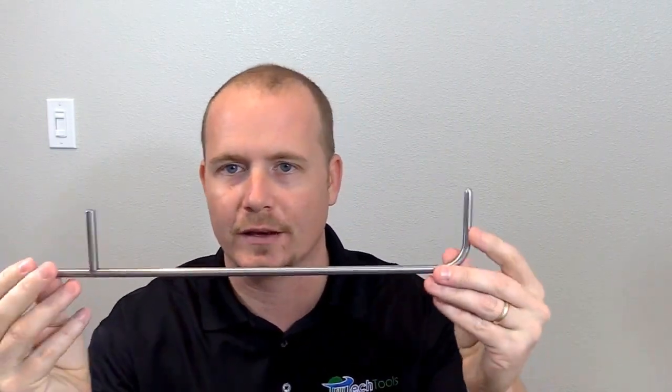There are a couple things I need to tell you specifically about the measurements I'm taking today. I'm using a short pitot tube, which is easy to handle and easy to demonstrate on a video. Generally speaking, a 12-inch pitot tube is not a really practical tool — pitot tubes are generally designed for higher velocity pressure. If you have a commercial environment with high duct velocity, a pitot tube is a nice, accurate way of doing that. I'm reading this in a residential application in an 8-inch spiral duct — not generally what you would use a pitot tube for. You would generally choose an anemometer of some sort, a hot wire thermal anemometer or a vane anemometer, to do this. But I'm demonstrating this tool, so I'm going to show you how to do the timed traverse.